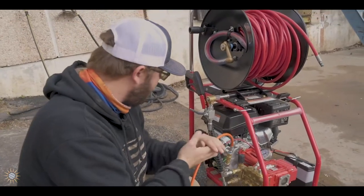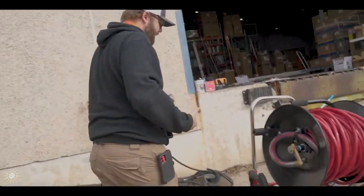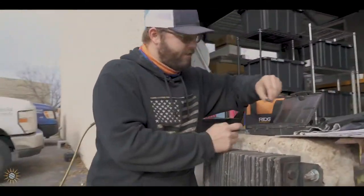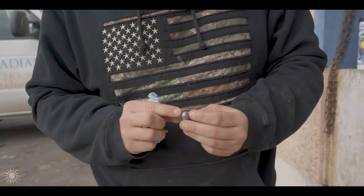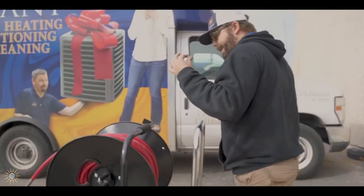While you're letting the system purge, look at what tip you're going to need. For the smaller hose we've got two different tips: one has a forward tip with four reverse, the other has no forward tip with four reverse. If you're going into a clog you're going to want a forward push so you can push through that clog and pull things back. If you're just cleaning the pipe, use the all-reverse tip so you can scour back into the pipe. Today we're going to use the one-forward tip so you can actually see the water pressure going through.